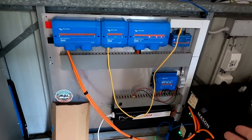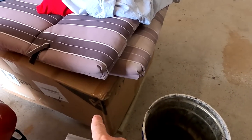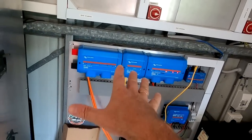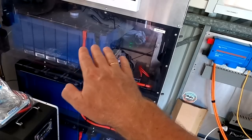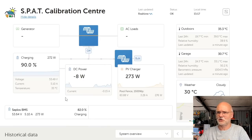I'm wondering if we can have even another BMS showing up - I have this 48V tower battery with a very similar BMS to the Seplos, and I'm wondering if this can be hooked up via CAN as a second BMS. Watch this space. So this all seems pretty good - we've got a smart shunt installed, we can hook up more batteries to the bus bar, and the Lynx Shunt takes care of state of charge for everything combined. This would be very similar to what we have here with the smart shunt and different battery banks - not much difference.